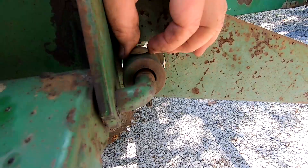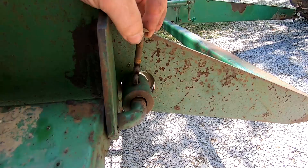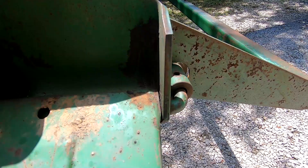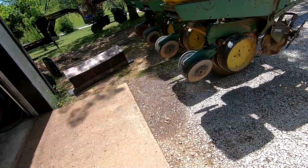It's going to be right inside there. We'll take this pin out — this pin is actually made to be a shear pin. In case you hit your marker on anything and hang it, it's supposed to shear this pin to keep it from bowing your marker up. So we ought to be able to get a hold of this marker arm and just rotate it back out of the way.